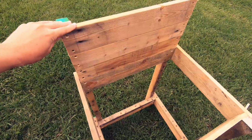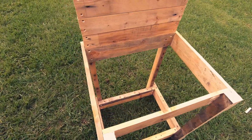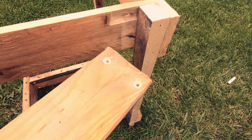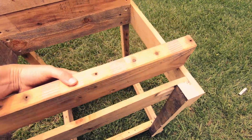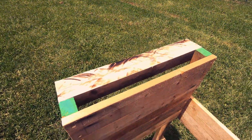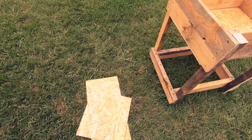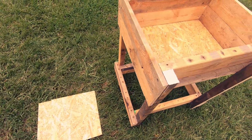Added a few backrest palings, refueled, then framed up the sides. I'm taking this paling out and replacing it with a stringer for extra strength. Added 2 ripped lengths at the back to rest the circular saw on and to hold the hammer. I used some scrap OSB as a bottom for the bench. This area is to catch the nails.